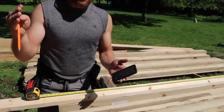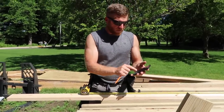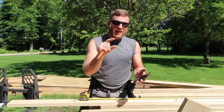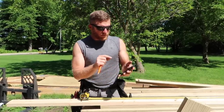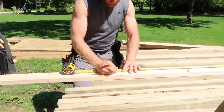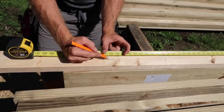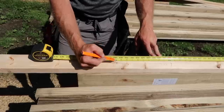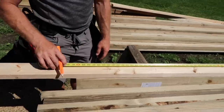I then take away our overhang pitch — it's a 4/12 pitch roof with a one-foot overhang. On that one foot I go down the hill four inches, so I take away four inches. Then I take away the fascia dimension — we use a two-by-six, so I take away another five and a half inches. That leaves me with 12 foot 9 and 11/16 inches. I mark that on the story pole — that is the top of our soffit nailer. We put a two-by-six there and we know when we go to run our soffit trim, as long as it's flush on the top of that board, it's going to be perfect.